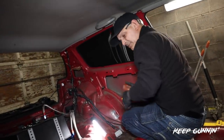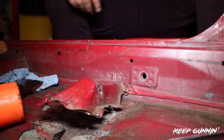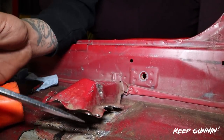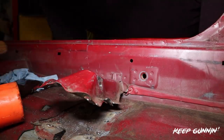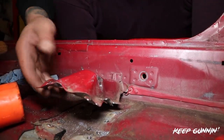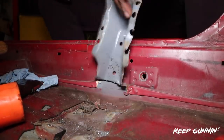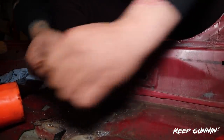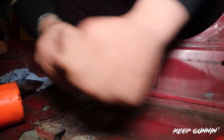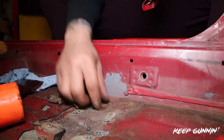Say what's up to the YouTube people. What's up? Good morning, everybody. God bless you. So what I noticed was that if you put a flathead to wherever you're using the spot weld removal kit, it just makes it a bit easier because you put tension on the piece you actually want to get rid of. So now I don't want to sit here and remove these two spot welds because it's hard to reach. Once we have it to where we can just bend it up and down, we'll just do that. We'll save some time. Maybe move it back and forth, and now we don't have to sit there and drill all day. Look at that — nice and easy. We're done. More lightweight and more money found.